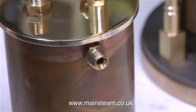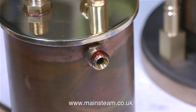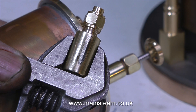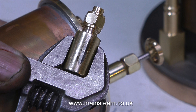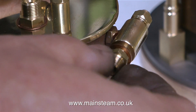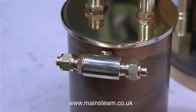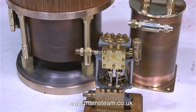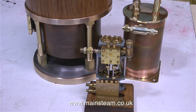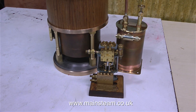Once the part is finished it's time to fit it to the condenser oil trap using Loctite 542 — not 603; 542 is just the thread sealant. Finger tight first, then using an adjustable spanner to tighten it all the way in. You may be wondering why I'm using an adapter on one end — well, if I decide I don't need two exhaust inlets I can just put a blanking plug in one end. In this clip is the small pump I intend to use on this steam plant — that should be interesting when it's all piped up. But for now, thanks for watching and I hope you found it useful.